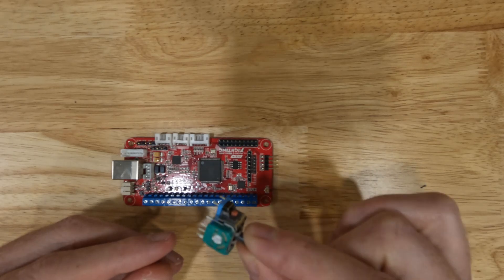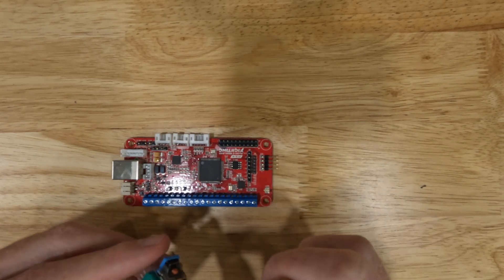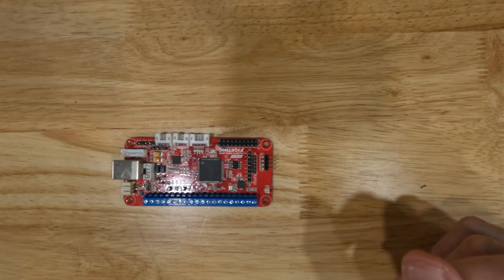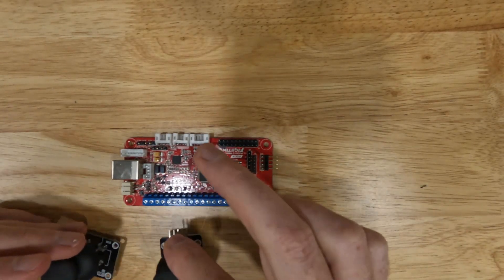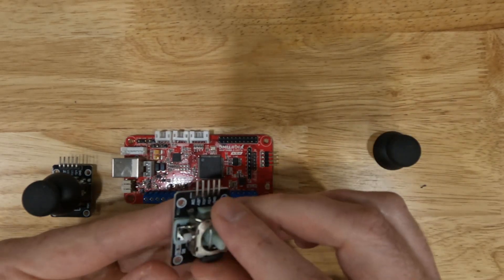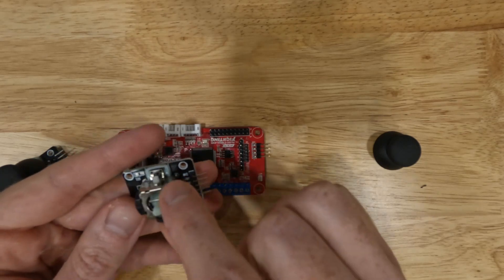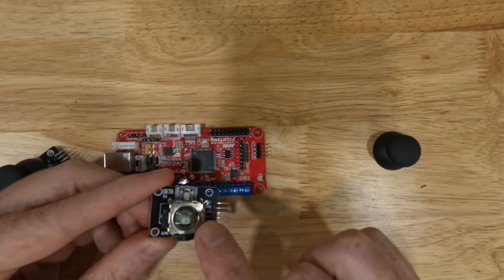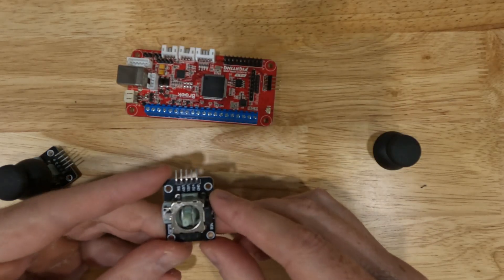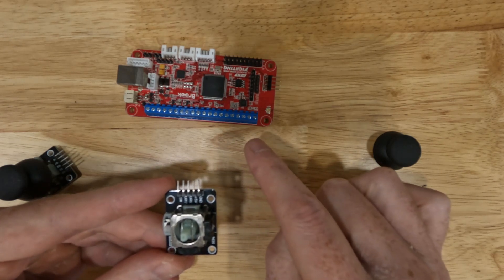I just wanted to show you what we're trying to replace here — it's all going to wire up pretty much the same way. So let's pull something in here that is similar. What I have here are two aftermarket analog joysticks. If I pull the top off, this looks really similar to the PlayStation controller we just looked at. This is an analog joystick mounted to a circuit board, and they have provided pins right here that you can wire to and take out to our wireless fighting board.